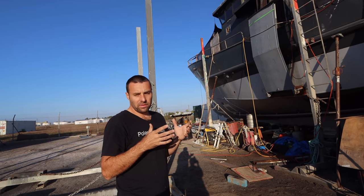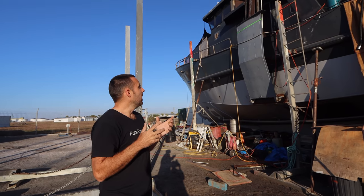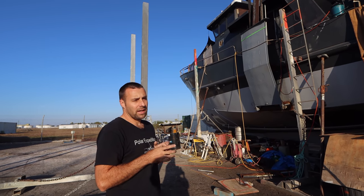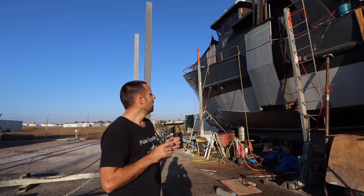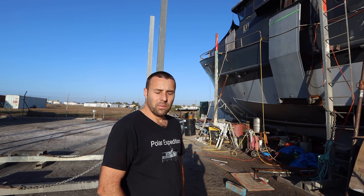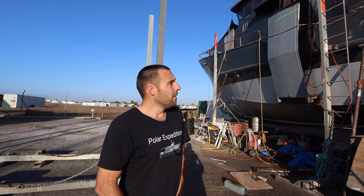Every pulley that you put into a system does add a little bit of friction, so you always have to account for that. Our wings weigh 380 kgs and our winches are rated at lifting close to 2.5 tonne. Some people have asked why we don't just mount the winch down on the bulwark and just lift the wing straight in with no pulleys, etc.